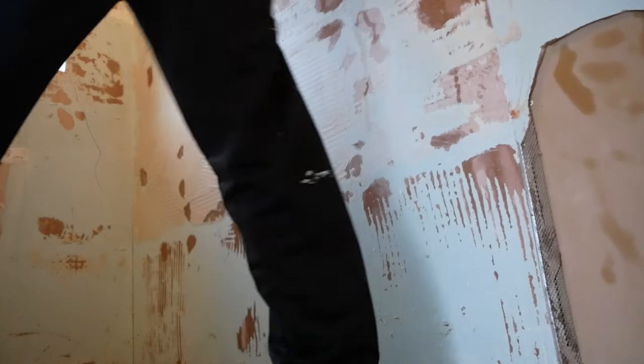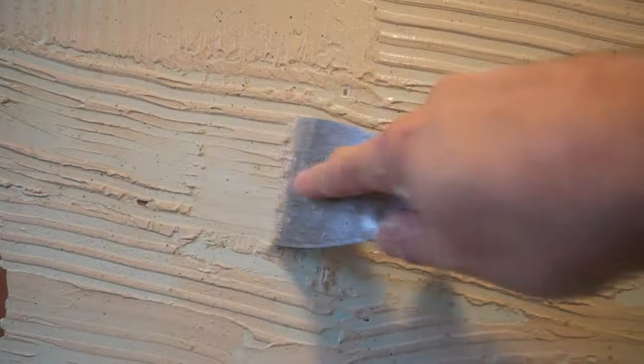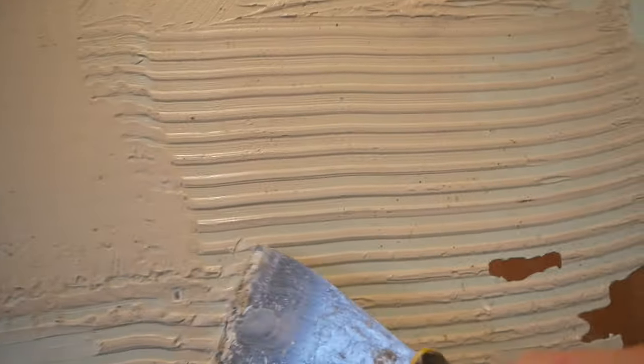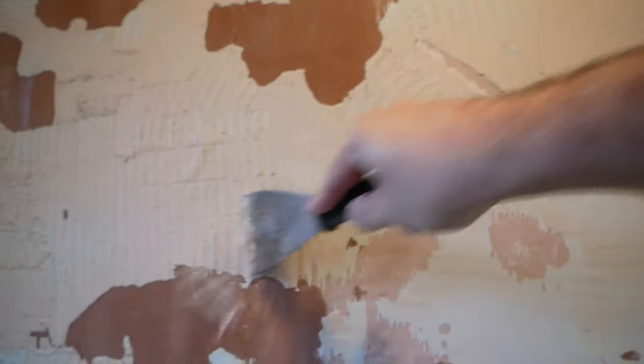By that stage I was using a brand new hand scraper, razor sharp from breaking it in on the first three or four walls. I had a couple more little walls to do and I basically learned it at the very end of the job. It got me more motivated — I'd felt like I'd done a full day's work just scraping with all muscle. Now I'm handing you the news: you don't need to use muscles, you can use your brain. Look at this — it's all soft, it's going to come off. A little bit of warm water, maybe some washing up liquid, might soak in and penetrate quicker. Though you may need to wash the wall down with sugar soap and dry it before plastering.